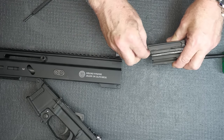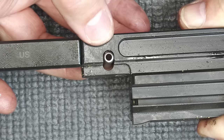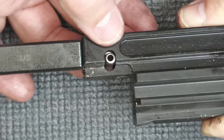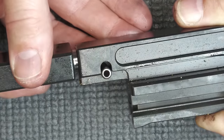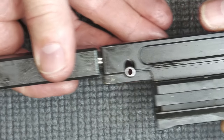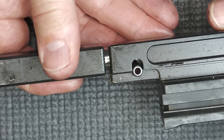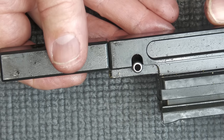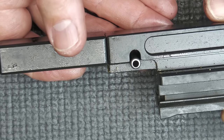And the pin that goes right here just fell out. The pin is where the magic happens. Right here is your delay system. And so when this pin drops, just like this, it drops into the lower position. It allows for this piece to move forward. So it allows it just to dwell for, honestly, microseconds before the bolt comes back, and that is your delay system.